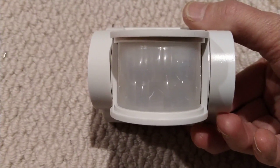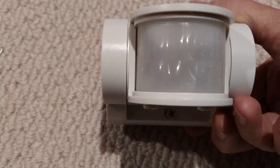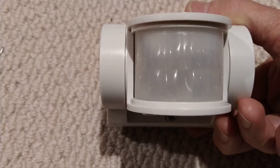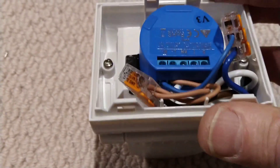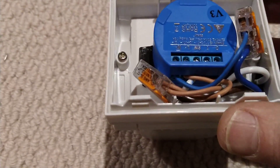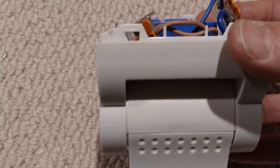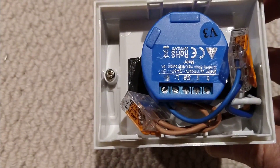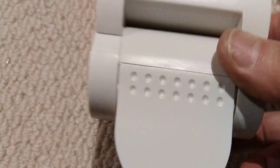The other nice thing is we live not far from the ocean in quite a high wind zone, and sometimes these sensors get a little crazy in really strong wind. So with my automation, I can have a condition that if it's really windy, the light basically doesn't come on to avoid going crazy. That's my little special use case for a Shelly 1 that you can squeeze inside an outdoor motion sensor.